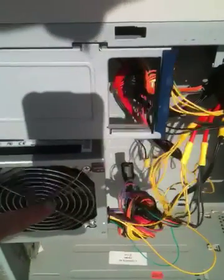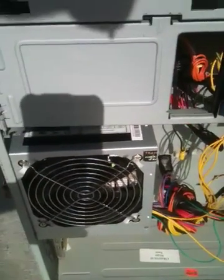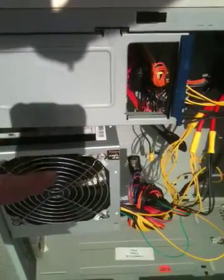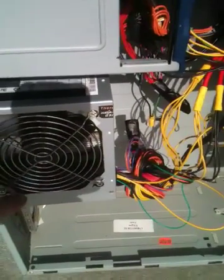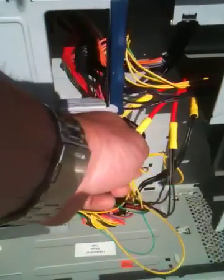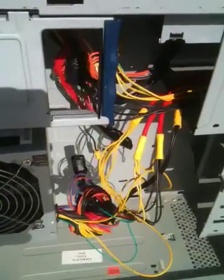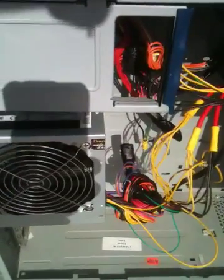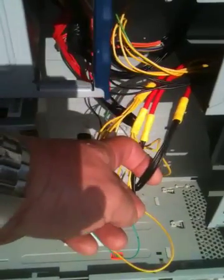This particular power supply at the bottom was a 450-watt. This one will deliver 19 and a half amps; this one was 10 amps. This has two 12-volt rails inside, so I put them together in parallel and doubled my amps, using the full 20 amps available. Equal number of black wires again.